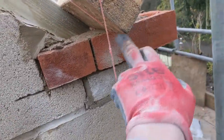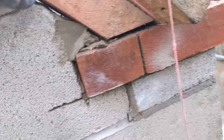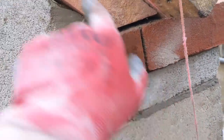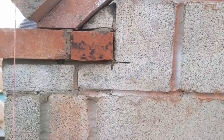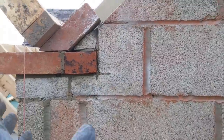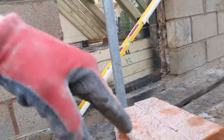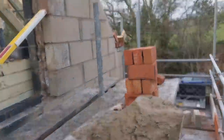Don't look too bad. I've had to change this brick detail to brick and half because this brick previously was landing halfway off the support. So I've made it brick and half so it actually lands on something. It works perfectly this side - it lands perfectly on one full brick almost. But I've just had to tweak that. It's because this side's higher and that side's lower, so when your landing brick hits your corbel it's just landing slightly different.